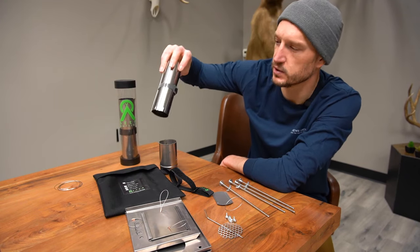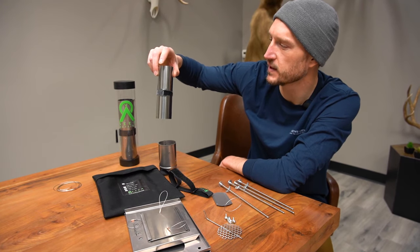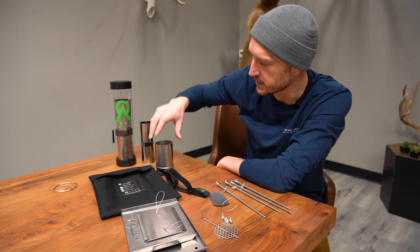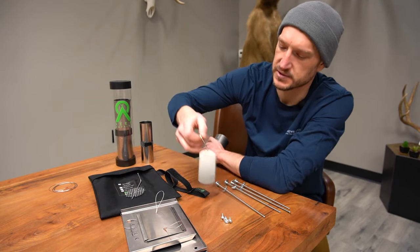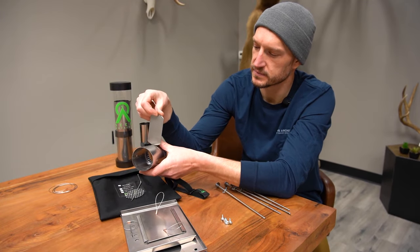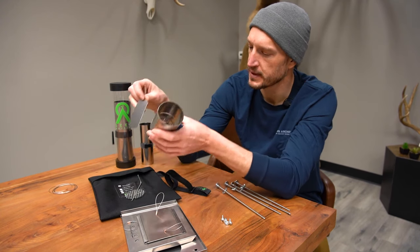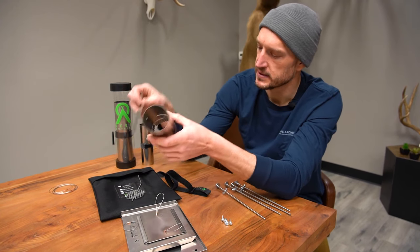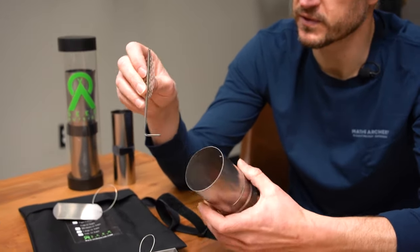You've got the U-turn portion of it here, which I will pull out in a sec and show you how that works. You also have the dampener and the spark arrestor. This is your dampener — your control on how much heat you burn out, how much smoke you let out. That just simply slides in here. This little spark arrestor can be a little bit tricky to install, so I just want to do a quick run-through.